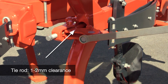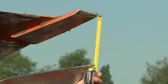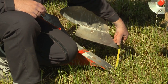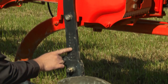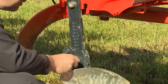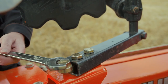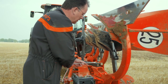To achieve good ploughing, the skimmers must be set to the correct depth. The normal depth would be 2-5cm depending on soil conditions. It is important that all skimmers be adjusted equally. Marks on the skimmer arm help you to adjust it. To guarantee a clear cut of the furrow wall, a disc colter should be adjusted 1-2cm wider than the furrow width. Move the disc colter to the land side and check.